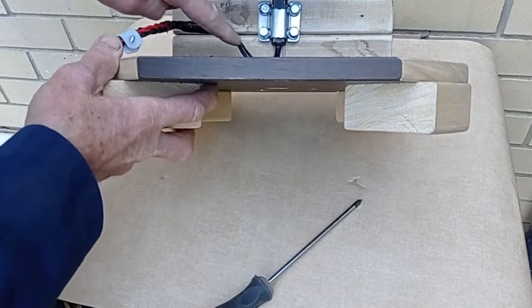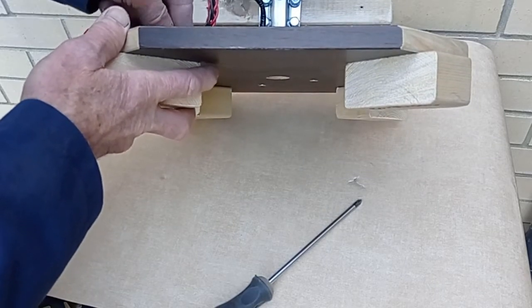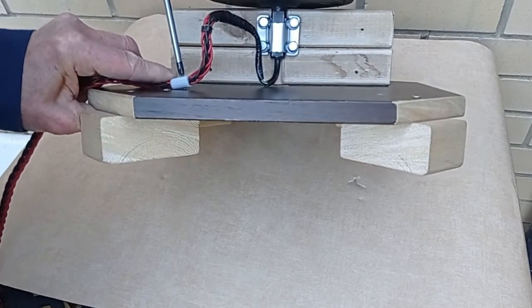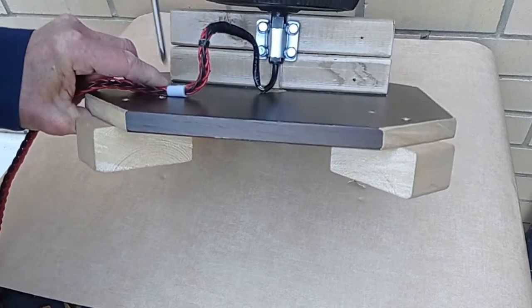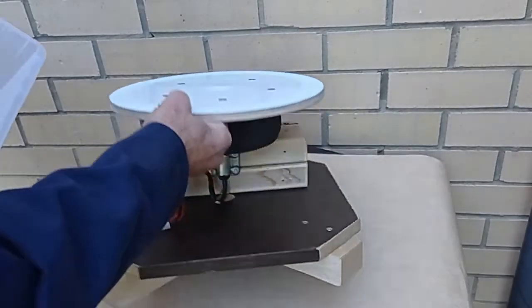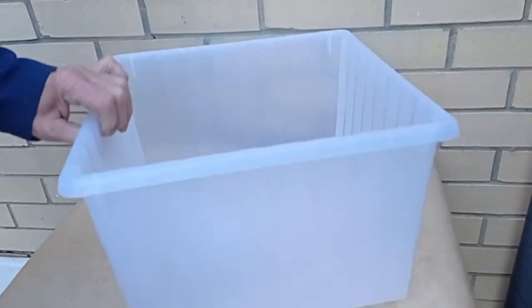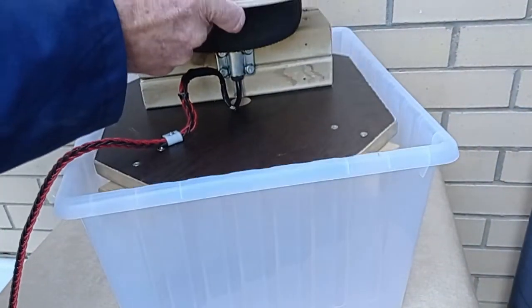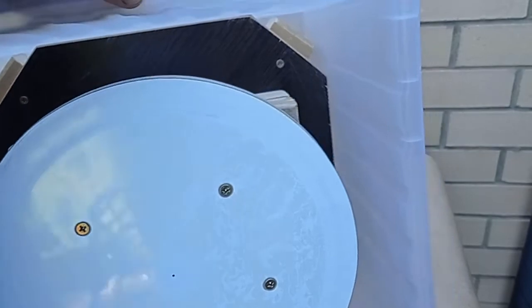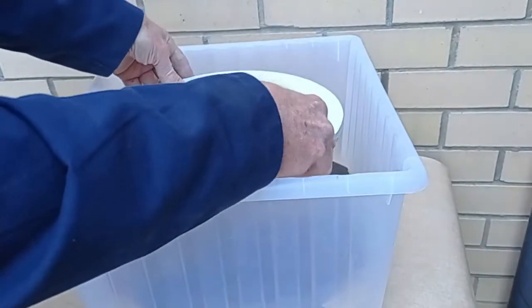Where the wires were joined, they were soldered and taped up with PVC tape. It's a good idea to keep those high so any water that drops on them rolls downwards rather than have them downwards and therefore potentially lying in water. There isn't much water ends up on that wire. Most of it splashes to the edge of the box of the drip tray. So all the controller and power supply sit outside of the box, and it's only that 36 volt motor, or 24 volt motor in this case, that's inside.